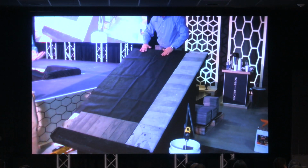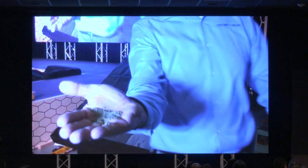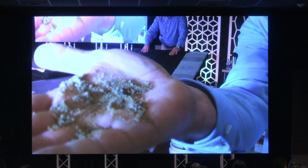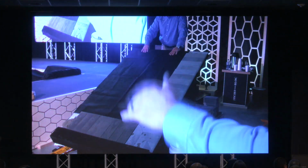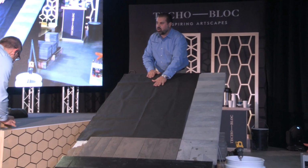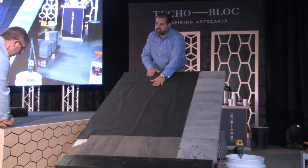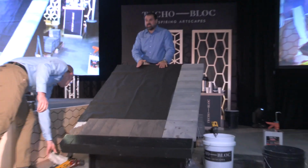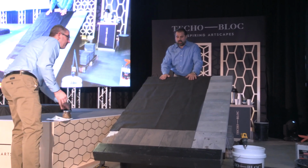On that other side, we would use a masonry sand. It's a little bit finer, more rounded particles, and doesn't have those little pieces of gravel in it like concrete sand. Okay. We're able to get a skimming or a broom coat over top of that concrete, just as long as it's not laying. Now, this is the Techo-Bloc standard, right? Using a geotextile and a little bit of sand in an overlay, correct? No, it's an industry standard. It actually is an industry standard, and we agree 100%.